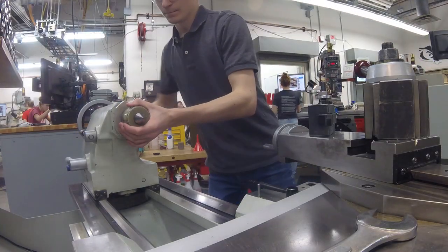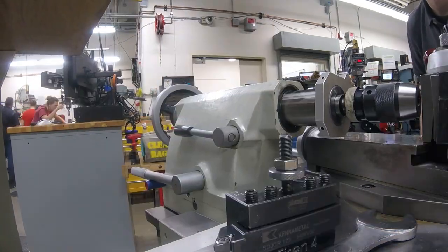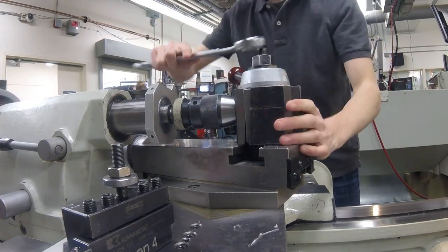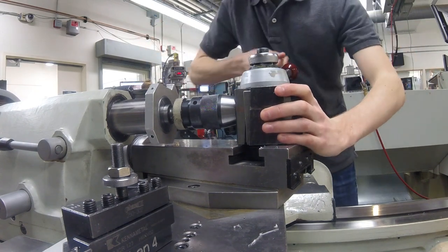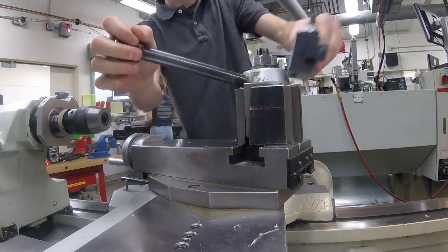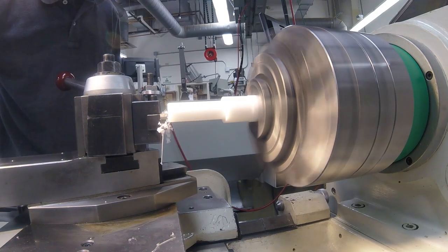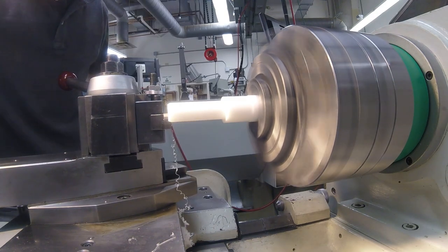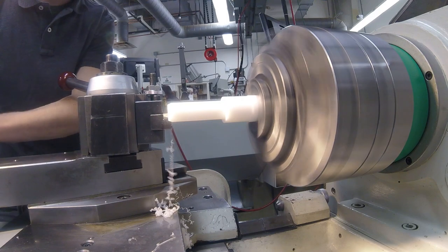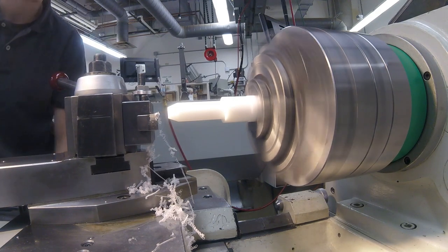Here I'm squaring the tool post back up since I just moved the slide. I'm putting a drill chuck in that's got a precision machine face on the end of it, so I can use that to square up on the back of my tool post. Once it's square, I tighten the nut back down so it won't move on me. I throw my tool back on the tool post now that it's all squared up — the height should still be good since I tightened that jam nut earlier. Here I'm starting to cut away that taper; you can kind of see that taper starting to form at the end of the piece and it becomes more well-defined as we go.